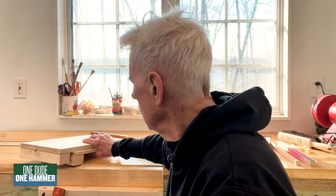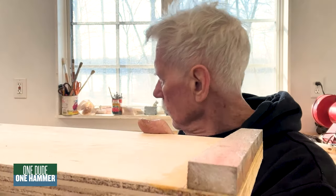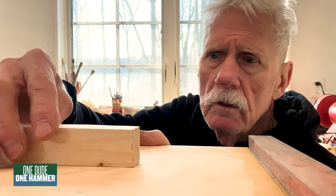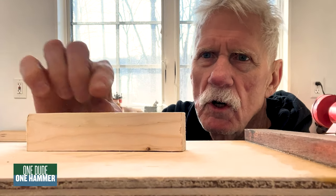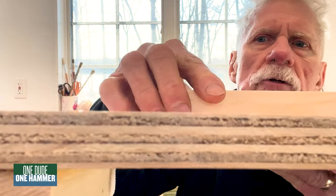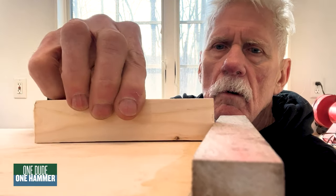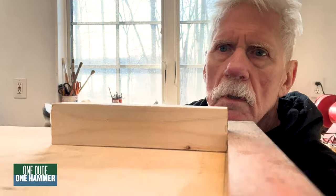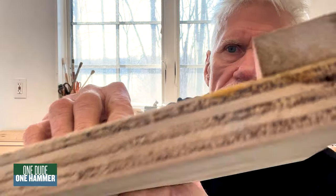Let me show you one of them here. We built this out of scrap. If you've got a small piece of wood to plane that doesn't have much for the vise jaws to grip, you put the bench hook against the bench edge and push the piece you want to plane against the stop. Then plane, plane, plane — you can do it fast and you don't have to mess around with a vise.